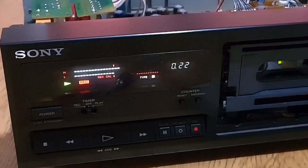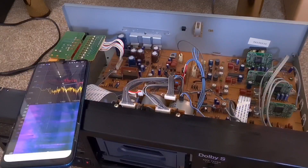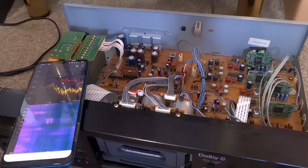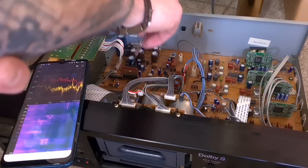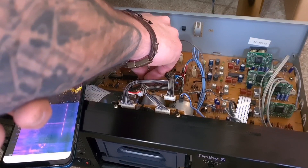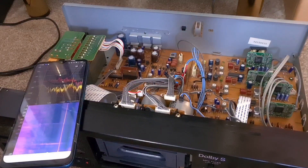Now onto a little bit of electrical calibration. I'll move to the floor, get it plugged into an amp, and run a tone through it to check the motor. New old stock motors are quite stiff to adjust at first because they've been sitting there for 25 years. Put 3000 Hz through it and see where we sit. It's just under to start - that first turn is quite difficult - but with a little bit of adjustment we hit 3000 Hz absolutely nail on the head.